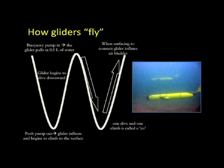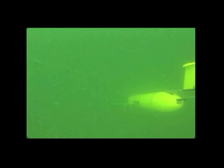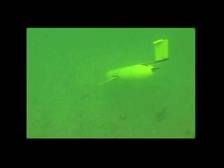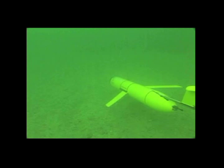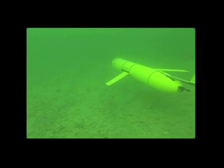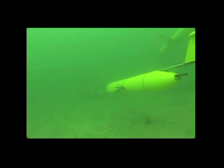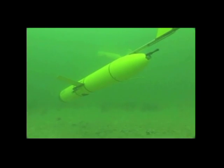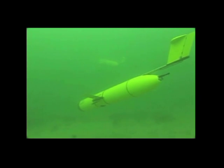This slide is going to show you how a glider actually flies. Each dive and climb is called a yo. On the screen in front of you is where you would actually see two yos. The gliders are neutrally buoyant when they enter the water, and when that buoyancy pump pulls back, it allows about a cup of water into the end of the system, allowing the glider to go down into a dive. Here's a little video footage from off the coast of New Jersey where you can actually see a glider diving and heading towards the bottom. Unfortunately, this one actually hits bottom before turning around and coming up into a climb — ideally that doesn't normally happen. Shortly in the background, you can see a second glider entering the picture, and this one does a very nice dive and is now inflecting and heading back up into a climb. This is all accomplished by just a change in buoyancy from that buoyancy pump.